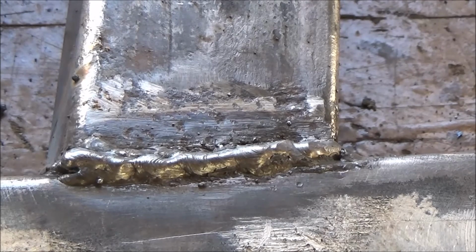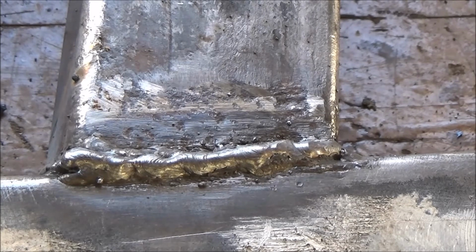I went back over to Deal yesterday, where I got the welder from, and I bought some 2.5mm welding rods. It's only half a mil different, but it's the maximum that's rated for the welder I've got, according to the scale on the side where you set the amperage. And they do work better. It took a little bit of getting used to.